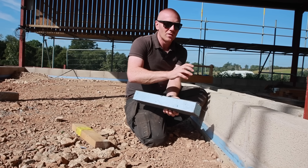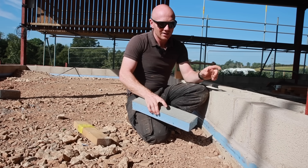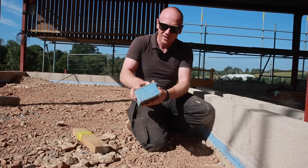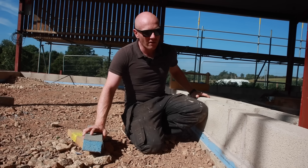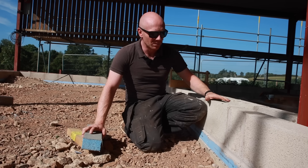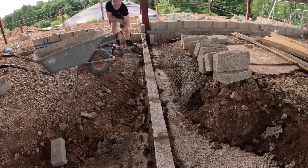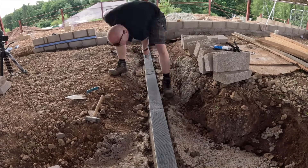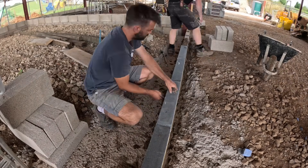They're not cheap, but if you've spent time and energy and money getting your walls, floors, and roof really well insulated, you want to make sure that when it comes to detailing around windows and junctions you get it right. We decided to put a block on top rather than fixing through the Thermoblock — that means we can fix into it wherever we need to without worrying about exactly where the concrete columns fall. The biggest plus point is they're really lightweight and easy to lay — we've all had a go. Even my 11-year-old daughter laid some. You just need a level and a rubber mallet to tap them down. As long as you've got a good mix they bed in really nicely.